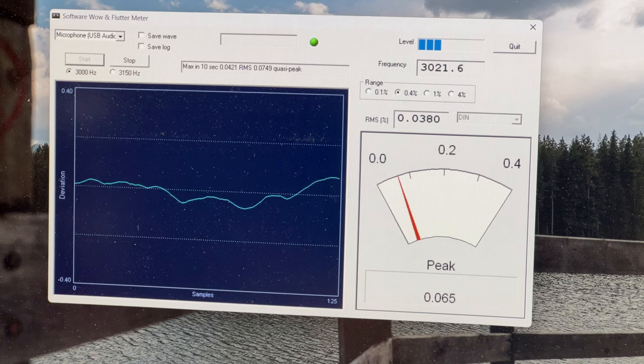One thing I should mention is I'm finding that with these Sony Metal SR tapes, a lot of these decks can't really peak them out very well. I'm not sure if any of them can, actually. The TDV931 could only go up to about plus 8 decibels. It couldn't get all the way up to the suggested level mark on that deck. And I've just been finding that with the Sony Metal SRs. So I'm thinking about getting better metal tapes for this kind of thing. But for now, the Metal SRs are what I have, so we're going to use them.